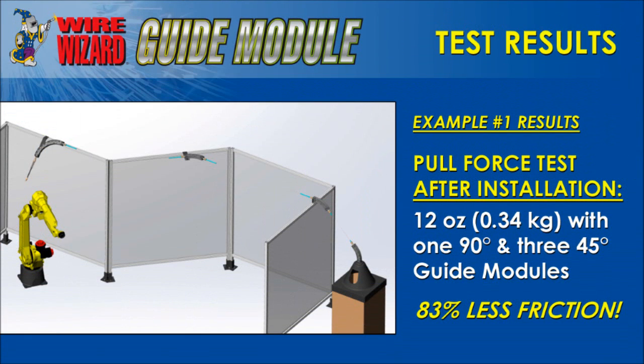After installing 3 45-degree modules and 1 90-degree module, and eliminating the excessive loops in the conduit run, the wire guide modules allowed a decrease of 3.75 pounds of force. This translated into a mere 12 ounces of force at the feed motor to pull the weld wire through the conduit system.